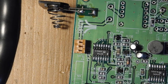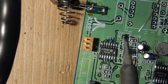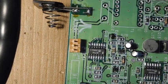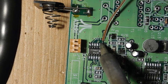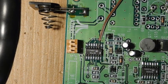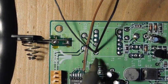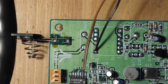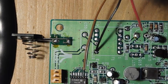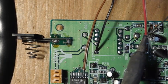The next thing we're going to do is wire in the backlight. To do that, we've got to go to the surface mount chip. I added a little bit of flux, and basically we're going to tin one wire and then just bring it in and attach it to this leg of the backlight chip. Then we're wiring in the power and ground for the screen. We can pull that ground from the power module, and the five volts is going to come in from where one of the ceramic capacitors used to be — so we just wire it in right there.